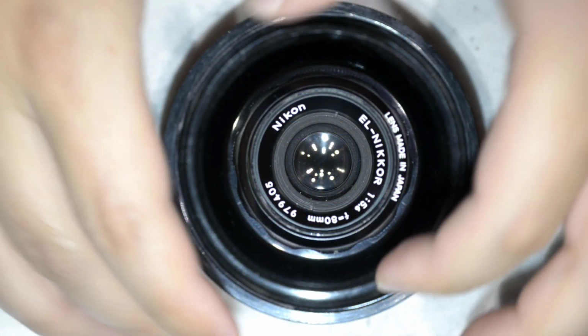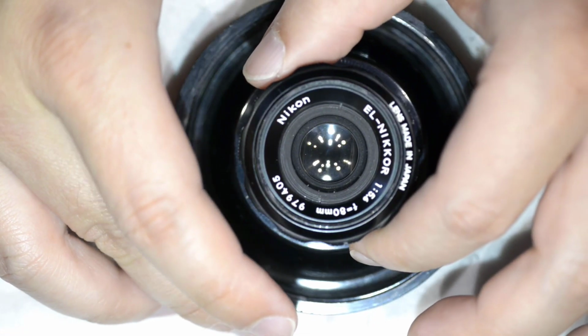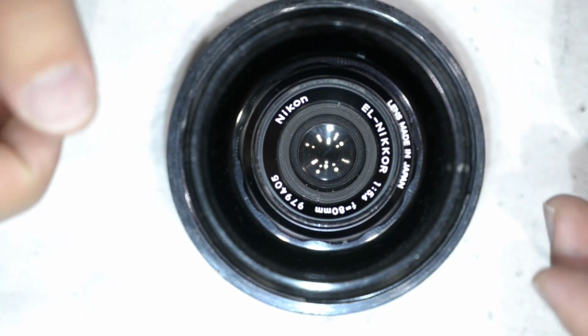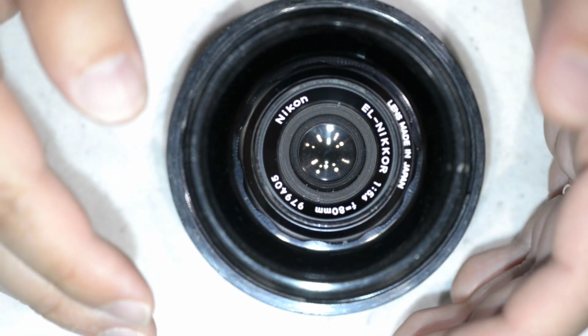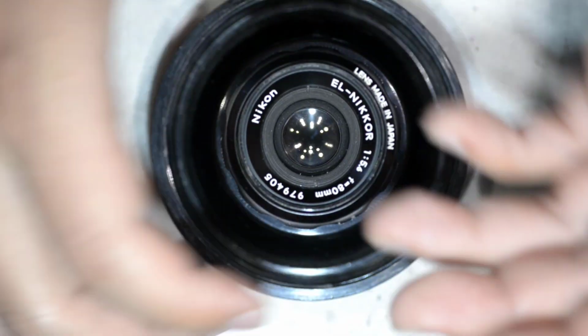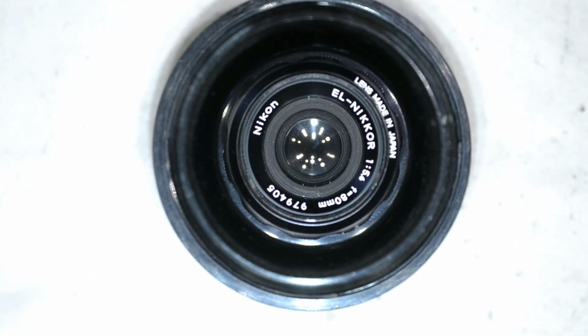This is one of the cool things of these lenses: it is suited for UV photography, as it lets pass light below 400 nanometers, which is the realm of UV light, and it's rather good between 325 and 400 nanometers, so you're able to do nice UV photography. And obviously there is the application of everyday photography.